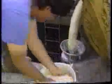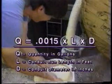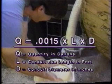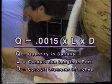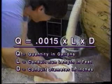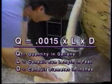It's important to use the proper amount of lubricant. The cost of lubricant is insignificant compared to the cost of cable, conduit, and installation labor. This formula estimates a quantity of lubricant for a specific pull: a constant of 0.0015 is multiplied times the length of the conduit run in feet and the ID of the conduit in inches to calculate a quantity in gallons. The longer the run or the larger the conduit, the more lube is recommended. This formula calculates a base amount of lube, and depending upon difficulty of the pull, quality of the conduit, etc., more or less lubricant may be needed.